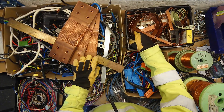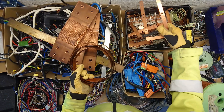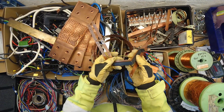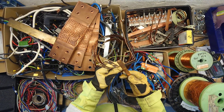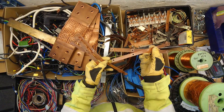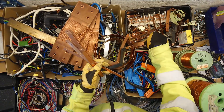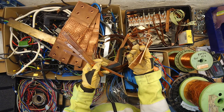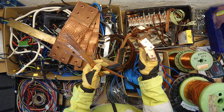Other than that, this is mostly salvaged copper bus bar and many of these are actually bus bars from 10 kVA inverters. Doesn't have to be any thicker than that when you have a lot of forced air cooling inside such a unit — this is normally what you would see there. Something like this thicker one actually comes from DC low voltage, high current inverters.